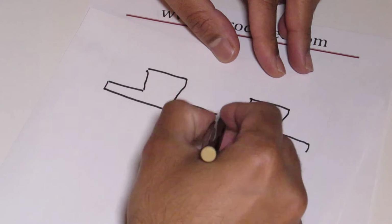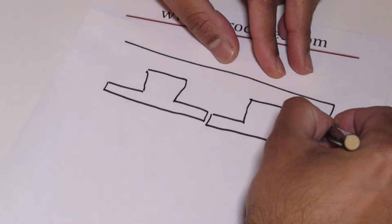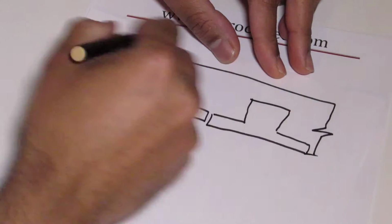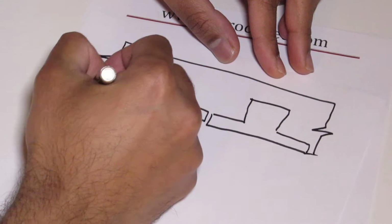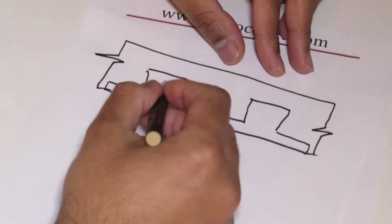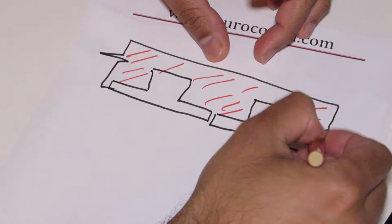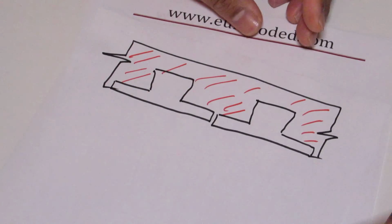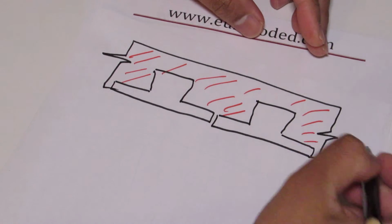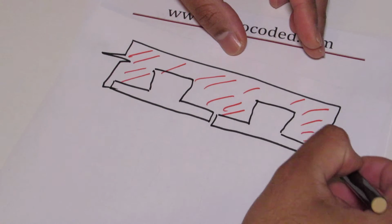They would look something like this. So you have these pre-stress precast units, and then you have this in situ concrete as the infill. One of the major governing points is the construction depth, because they are quite shallow.